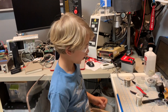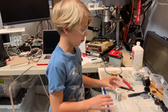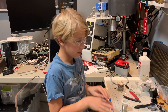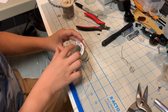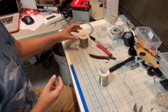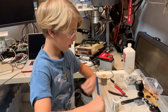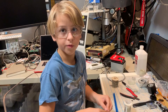Hi, I'm Enzo Carter and today I'm going to make a fusor cathode — the centerpiece you'd find where the plasma is — out of 0.77mm stainless steel. Last time I used 0.46mm stainless steel. Basically, you just wrap it around three times, tie it while it's still on, take it off, and put them together.